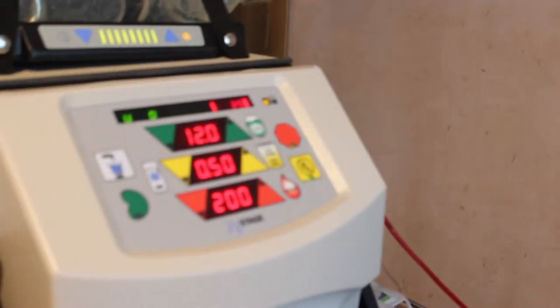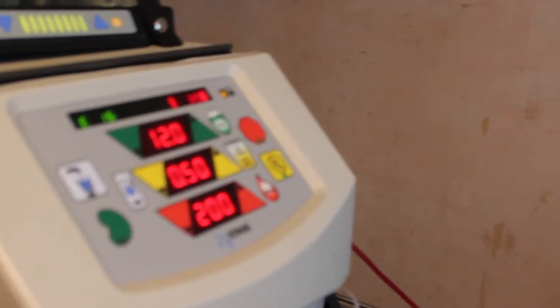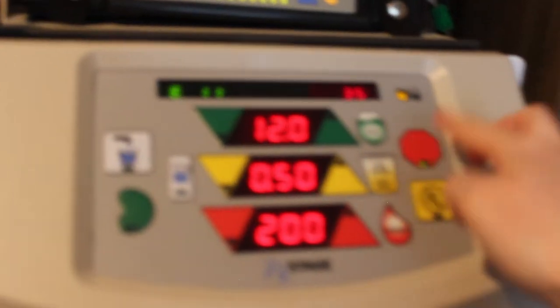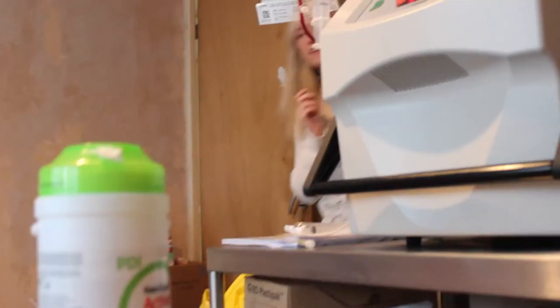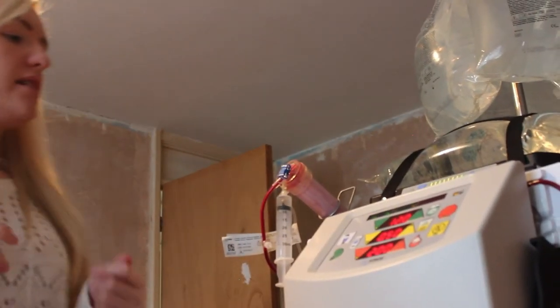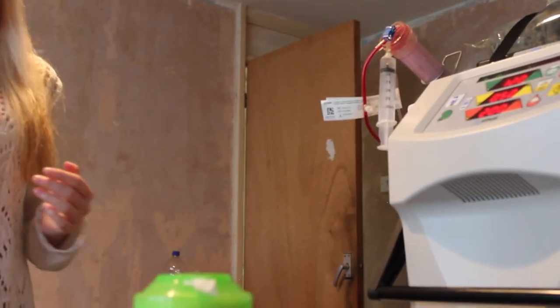We've just got an alarm — that's 35, and I think that's the wasteline pressure too high. So all you have to do is check the wasteline down, press silence which is the yellow button, press stop. Then go and check the wasteline — check all the air clamps are on, check it's all attached, it's not too tangled. The machine alarm is just telling you to hurry up. Once that's done, press go again which is the green kidney button and see if it works — and that's all you really have to do for that particular alarm. I'll be back when I'm taking myself off.